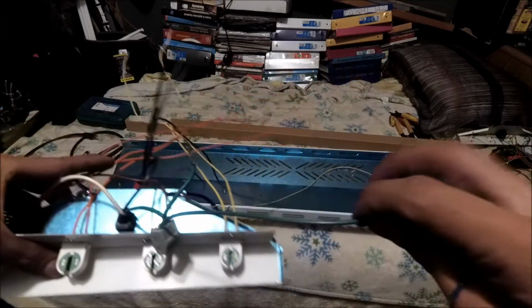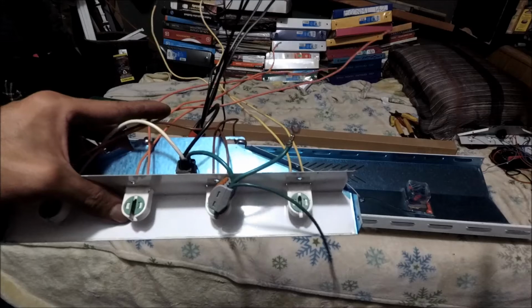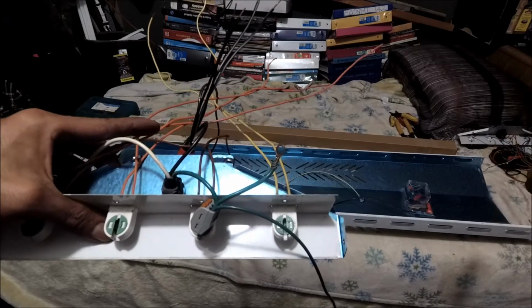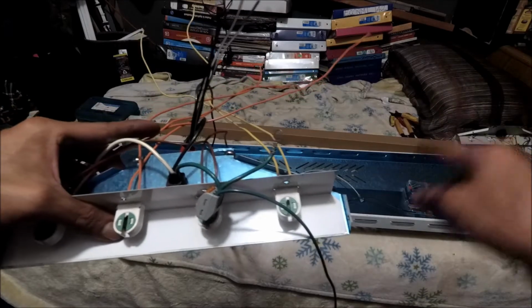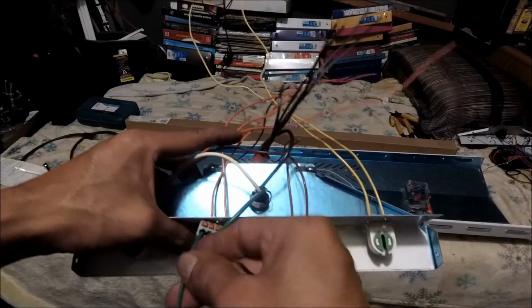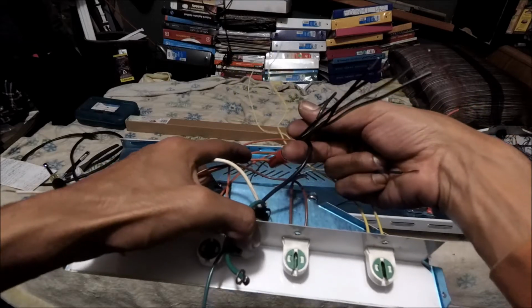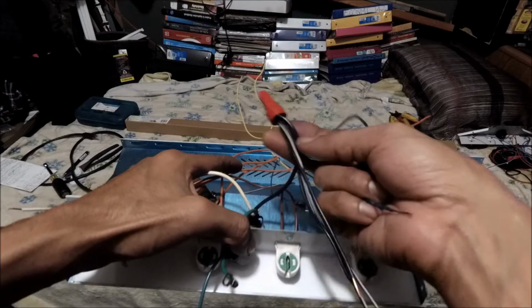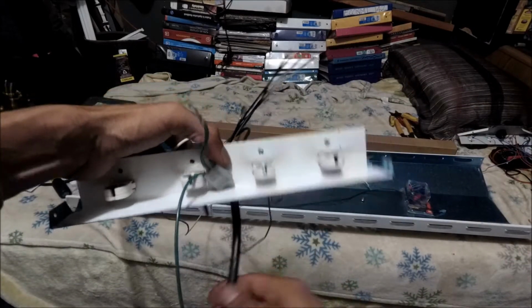Okay? And then the long conductor, the green one, is the one that goes to that end of the tombstone. Okay, to the link, if you want to link another light fixture, you know, do the daisy chain connection. Okay, so that's your ground. And now your hot, your line, or your live. Alright, it's your hot, so it's the main one coming in from the main power.